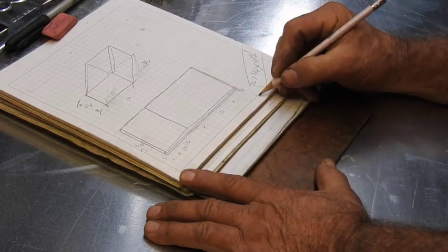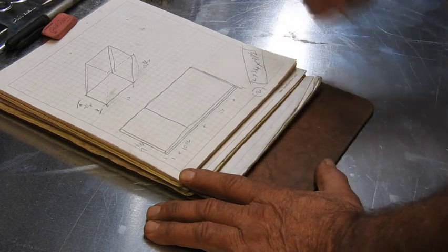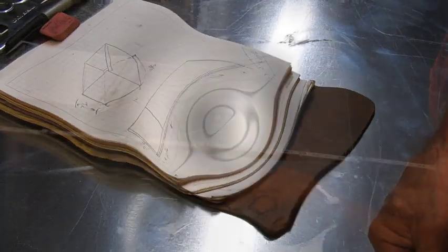Take that times two. So if you're making yourself a note, you go: two pieces, 27¾ by 8½ — cut them out and you're ready to trim and make your two pieces of duct half.